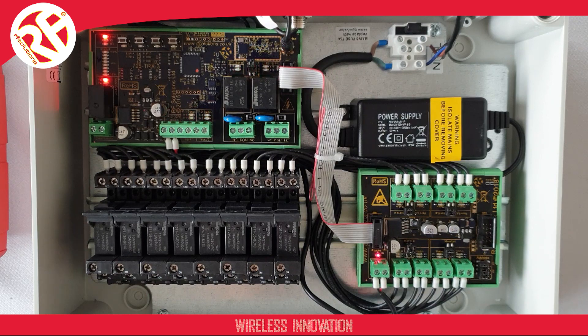That is connected by a ribbon cable to our expansion output module, which gives me eight separate outputs. These outputs are driving these eight DIN rail mounted relays. Each of these relays gives you common, normally open and normally closed changeover contacts.